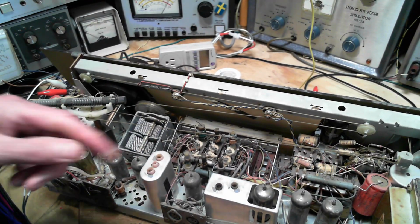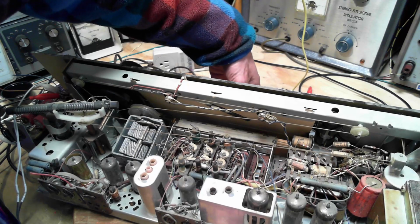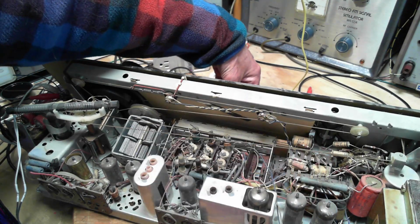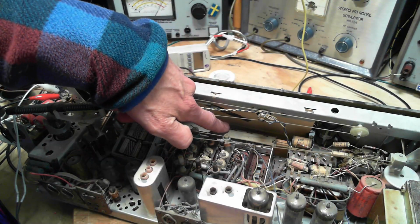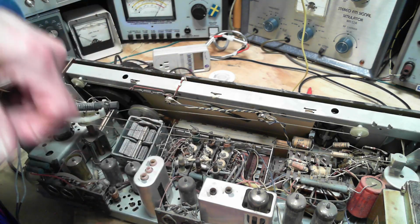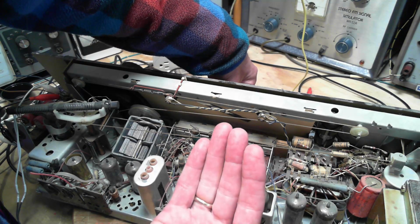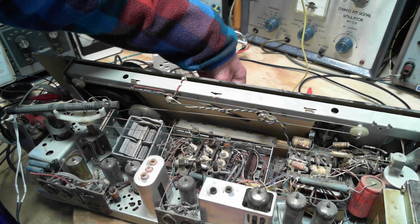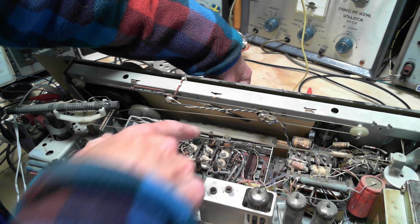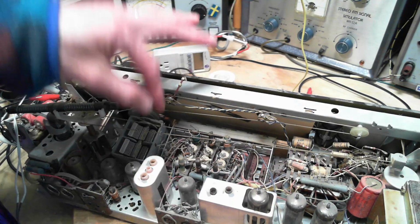Switches. All down under here. So this plate you can see wiggling here is probably the release plate. Each switch comes out, I just push the button here. A little tiny tooth has grabbed this plate. And I go to push the next button, that plate is going to rotate up and the tooth is going to slip off of it and that button's going to regress. Here we go, plate up, there, that button's gone. And now the little tooth is sticking here for the button I just pushed. So you call that a release bar, I would say.